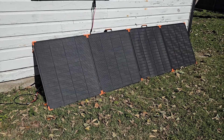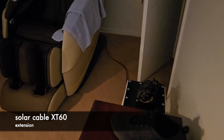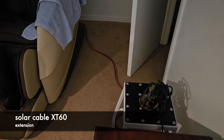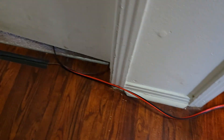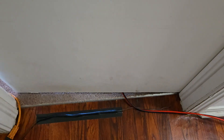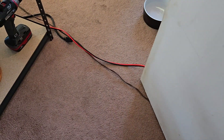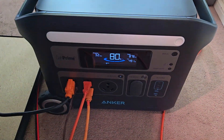These are much more solid. I have the 35 foot wire, and the longer the wire, the more power that's lost getting to the inside of the house — there would be even more power with a shorter run. The longer your wire and the thinner the gauge plays a lot into how much power is delivered to your battery bank.